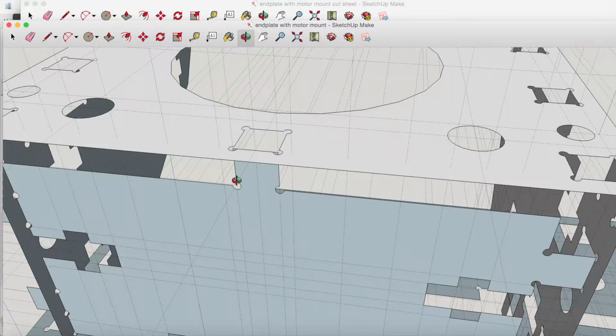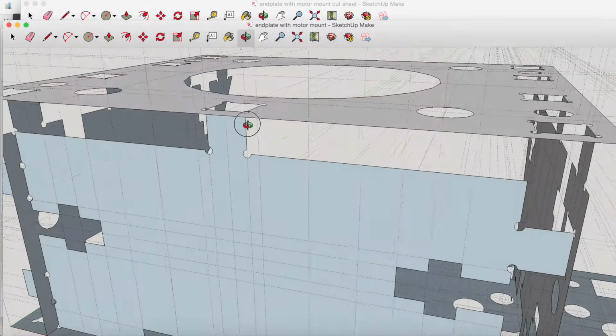So if I hadn't put that circle at the corner, these corners would obviously have, instead of being a right angle as it would appear in SketchUp, turned out as a right angle but with a slight rounded edge, which wouldn't allow each of the flat surfaces to go fully into the join. So by putting this little cutout, you're making it possible to fit a 90-degree external angle into that 90-degree internal angle without any sort of clashing. So that's how to do a tab.